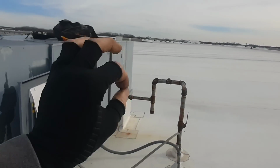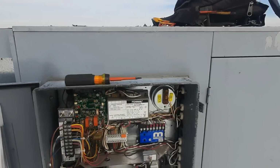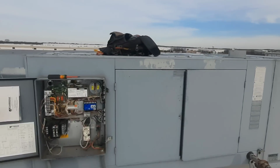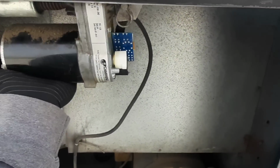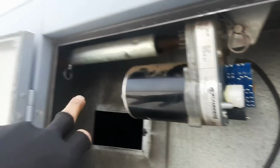That's perfect. You saw it didn't bind up at all as it was opening that damper, and it came on right when it was supposed to. So I kind of like where it's set. Let's put it all back together and get my temp sensor in there, and then we'll see how everything looks at that point. So again, I went through the steps. I'm not trying to do a DIY here. You just want to make sure this is not bound up. It's got some play with your linkage here and on the other side. So it's got a little bit of play.